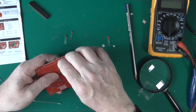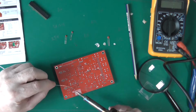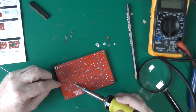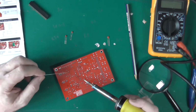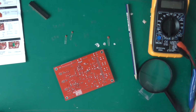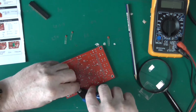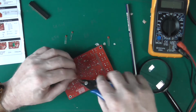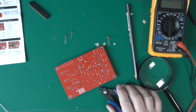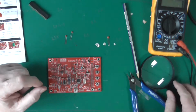So capacitors have multiple purposes, from storing electricity, which is their primary function, which all capacitors do, to making timing components for oscillators and tuning different frequencies in or out. Providing a load for things like crystals, and electrolytics are only ever really used for smoothing power supplies and providing a long timing delay. Ceramics and other types of capacitors are generally for decoupling and causing very specific timing on oscillators.